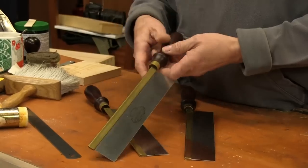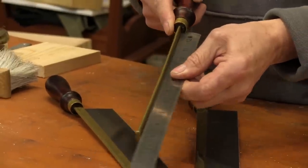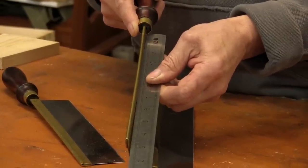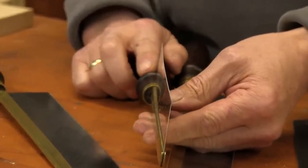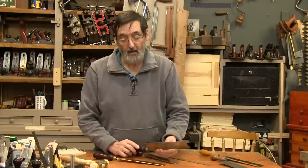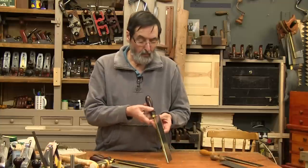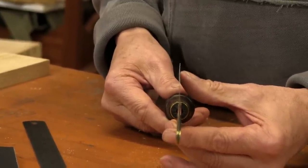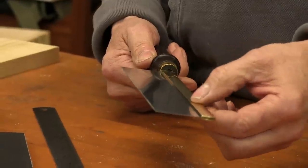This saw came from the manufacturer with a bend in it. Can you see how much the bend is in the back of that saw? If I turn the saw over and look down the length, you can see there's a bend all the way along. That means the back is bent and therefore the plate is bent. But on this saw I worked on previously, the blade is straight — you can agree it's straight along its length.